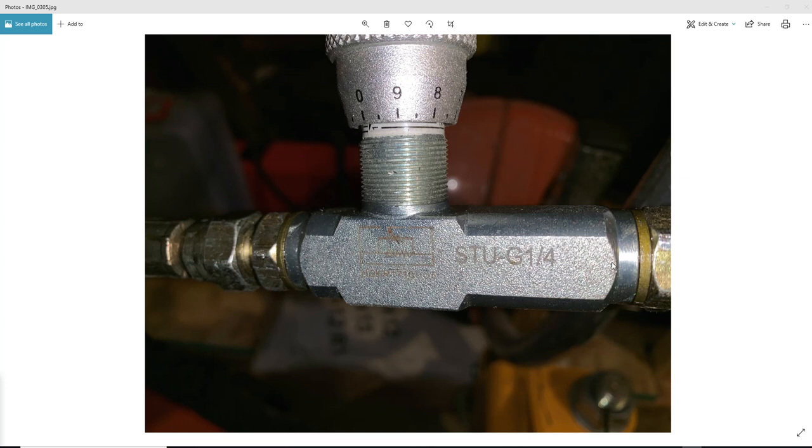When the pressure is too low, it doesn't matter — it pushes back that little ball on a spring and allows full flow, or pretty close to full flow. When setting it up, this side of the valve should lead toward the bottom of your cylinder, and this side should go to your tractor. That way, when you put fluid into it, it goes full flow — you're not worried about how quickly it stands up, just how slowly it comes down.